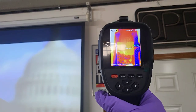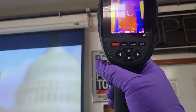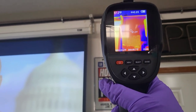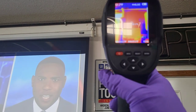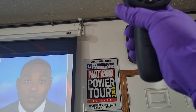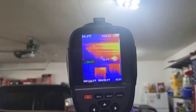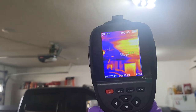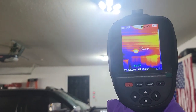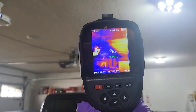The upper cavity is probably showing red and warm because heat has gone through the drywall. You can still kind of see the studs there. There's a room above this garage — a bedroom — and you can see where it's insulated and where it's not. There's clearly no insulation in the ceiling either.